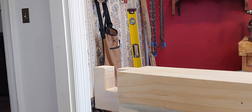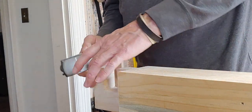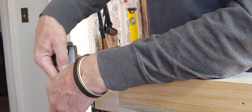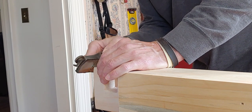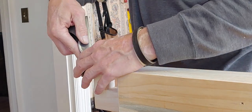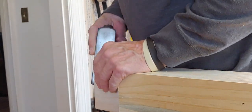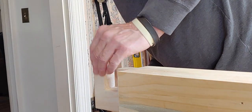I've been using a chisel on these joints to clean them up to fit, and they're kind of shiny. The sanding will give you a little bit of dust in there - makes it go together easier. I'm going to chamfer the tenon just for a good look, and as good practice so I don't blow out the backside. I'll just take a nick off the sides - doing the 45-degree cut across the grain first, just because it's good practice. These are more of a little aesthetic chamfer - it makes it look purposeful.